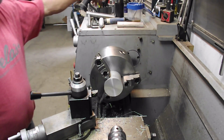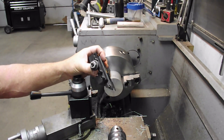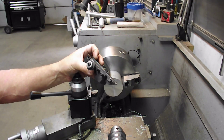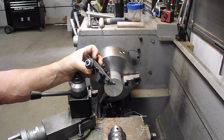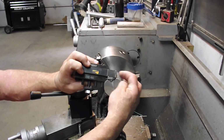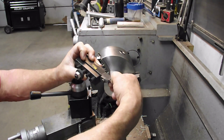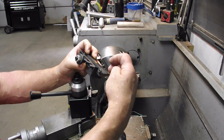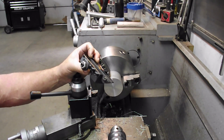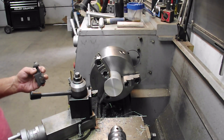Next thing I am gonna do is I've got these little Sandvik tool bits, and I use them for trepanning when I have to. They don't have much underneath here, so it gives me some clearance, and it's cut away on this side, so I don't need to worry about the arc of the cut. So I'm going to get set up and get you into there.